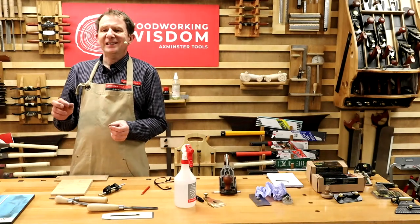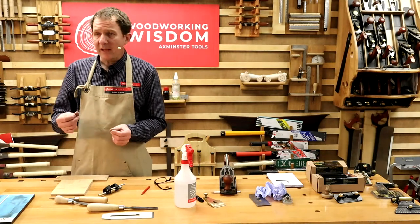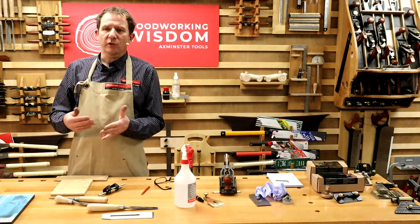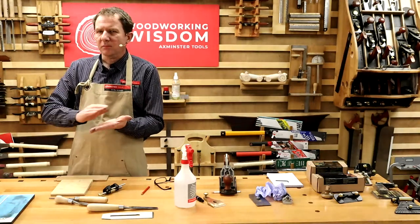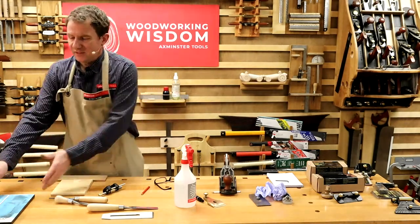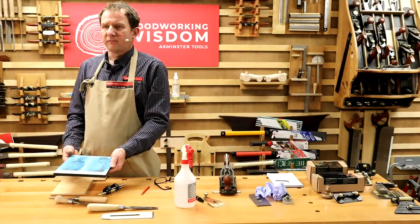Okay. As long as it's still cutting, you will know because you're removing material. Marker pen's a really good way of sharpening. All 3 of us use that definitely when we do the teaching side to help demonstrate what you're removing. Even from my point of view at home, though, I go with a colour marker pen to make sure I'm catching what I want, get the accuracy I'm looking for, 30 degrees. That can be a good way to be sure to see it.